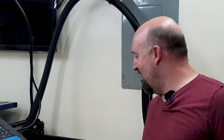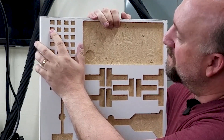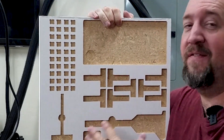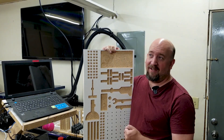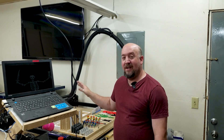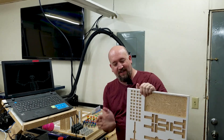I had to come and do a redo on my editing. My audio didn't turn out very well, so I've already got the bitboard done and we'll show you how we did that later. With this one, I had a bit of a problem and I was getting the dog bones. I'm going to show you what I did on how I fixed that. I did a couple different tests on bits and also found that my X-Carve needed some fine tuning. That's the whole reason this just wasn't working for me, so we had to redo it.